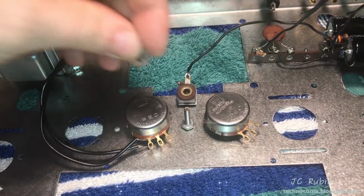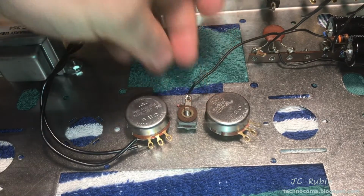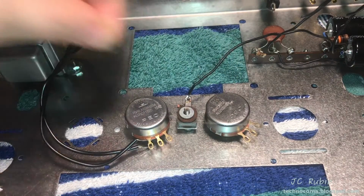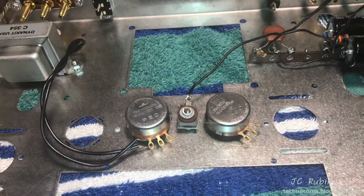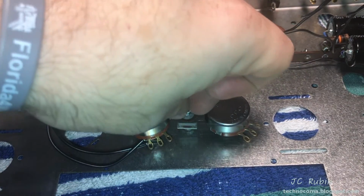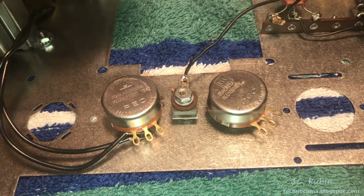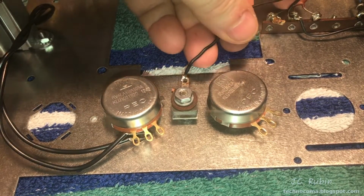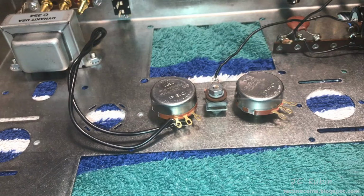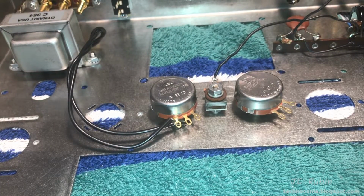So now we'll set the rectifier on, drop on a washer, then the rectifier, and the washer, then a lock washer. It comes out just perfect. Then the nut. There we go, rectifier is perfectly situated in place. This is done. Mounting's good, nice and tight. Everything's set up exactly as it should be. It's even further off the chassis than original. That's nice too. So yeah, very cool.